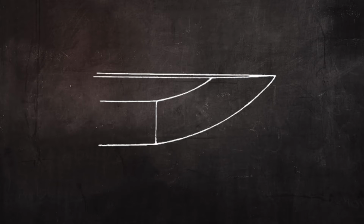In lots of modern, inexpensive, mass-produced katanas, the yokote line is purely ornamental. In other words, the only difference between this part of the blade and this part is how they're polished. But in a well-made katana, there's a slight difference in geometry between the cutting edge on this side of the yokote and the cutting edge on this side.